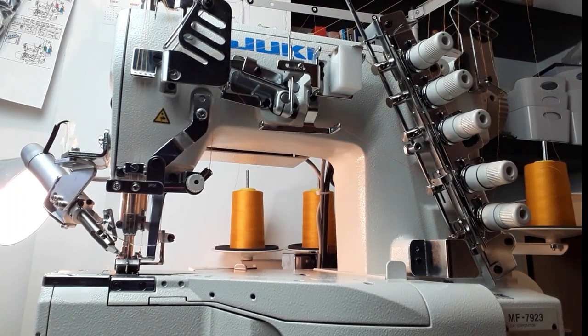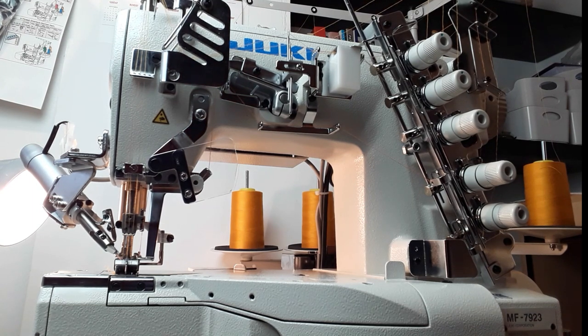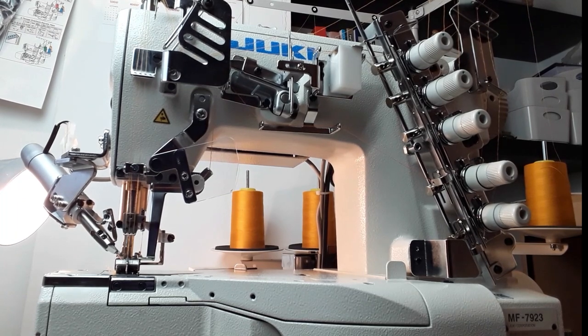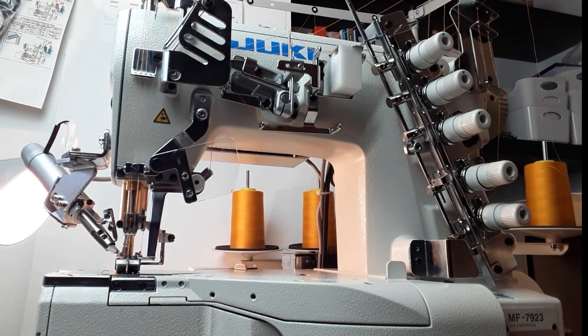The direct drive motor system means the machine starts and stops instantly — it's extremely responsive to one single stitch. There is no belt and no belt shavings; the power goes directly from the motor to the machine. But these micro improvements come at a price: this machine is twice the price of the same head with a servo motor. Don't buy a clutch motor if you can avoid it, but a good servo motor will also work amazingly well for half the price.